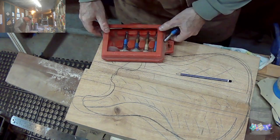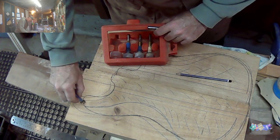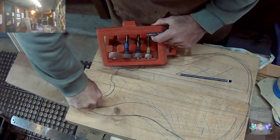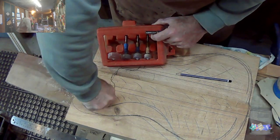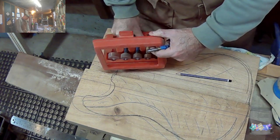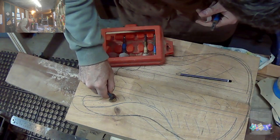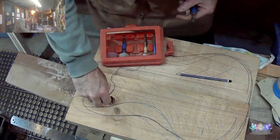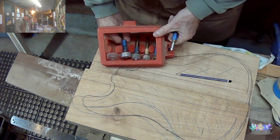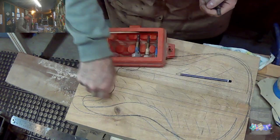Need smaller ones in here. I'm going to grab the little guys, these little baby guys. We're going to put this little guy in here. Grab the 3/4 inch and put some of those smaller ones, medium-sized holes right here. Just checking. I'm only using the drill to see how far away from the edges I am. I could go bigger. I will go bigger because I want to have less to route, if you know what I mean. Because all the edges will be straightened out with a router. I'll freehand that with a router and then use a bearing bit to get it cleaned to the bottom.